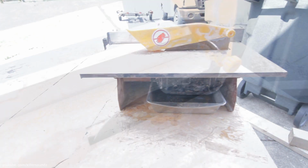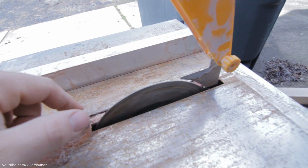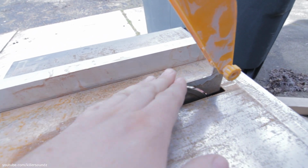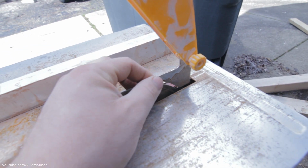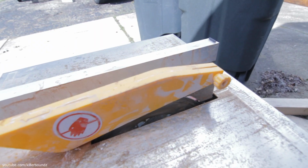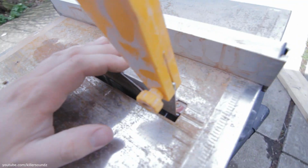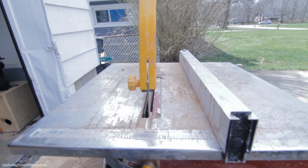One of my only real complaints here is once this disc starts wearing down, which it does pretty fast. I was cutting a bunch of little 4x4 white tiles before, and it wore this thing down enough to actually be thinner than the spreader here, which also holds this, which you kind of need on here because the water will just shoot everywhere. So what will happen when your blade thins out like that, the tile will pinch around this and it won't go through all the way.